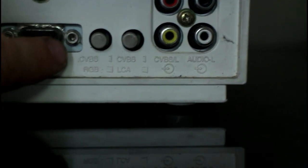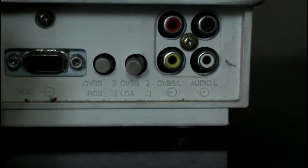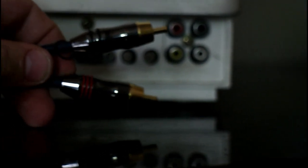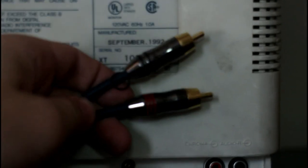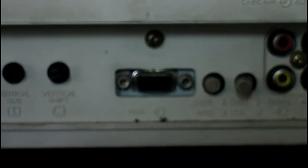There's a manual that shows you how to do it. Hopefully the RGB works — I don't have a way to test that yet. I'll show you what the cord looks like for Luma/Chroma: there are basically two splits, just RCA jacks, nothing fancy. I use shielded ones. There's the S-Video end, and it just splits the luma and chroma from the S-Video into two separate RCA connectors that go into the monitor. For RGB I need to get a 7-pin connector to BNC, and then I can go from SCART to BNC.